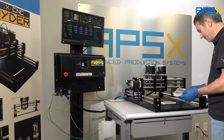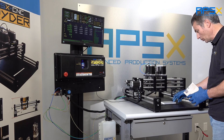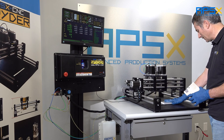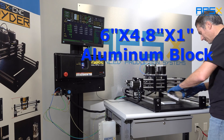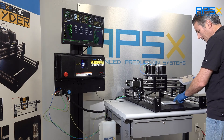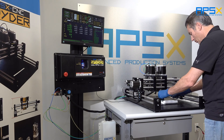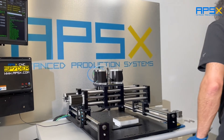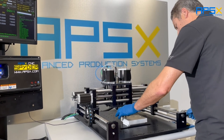For our molds that we make for our PIM machine, we use the setup jig — it's got some pre-drilled and tapped holes, and we faced it so it's got a pretty true surface. We get our blank mold, make these holes halfway, and this is five and a half inch center to center. We have two threaded holes that match, and we use two one-inch quarter-20 bolts — this is how we secure them.